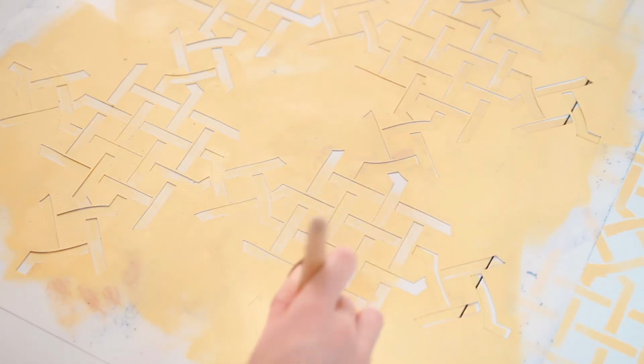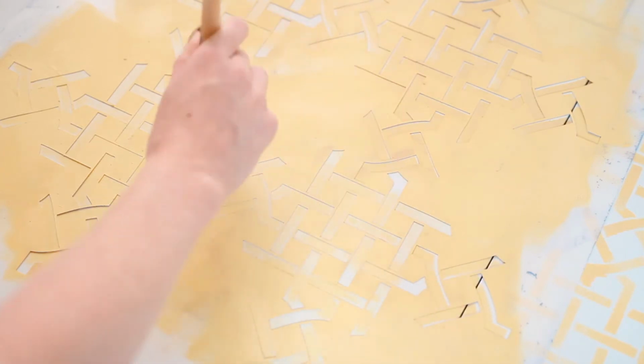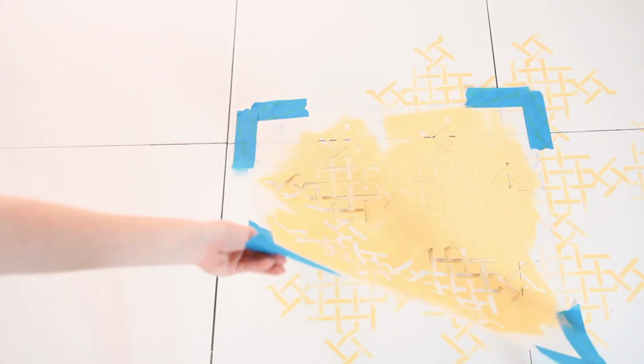Now, I don't know if you guys can tell, but there are parts that are lighter and darker in certain areas on the stencil. Now, this is where you would want to go in with a second coat in order to get your stencil filled in completely solid, since, like I said before, your brush should be pretty dry, so your first layer shouldn't be even and it should be fairly light. But I really want to go for a kind of rustic look, and so I might keep it at this first layer because I do like the inconsistencies and the texture and the variety that adds. I ended up going back in with a brush by hand and making certain areas darker to kind of emphasize the distressed look I was getting by one layer of a roller.